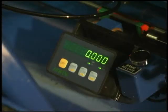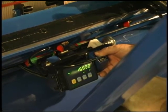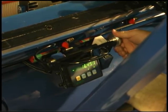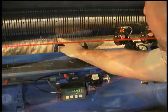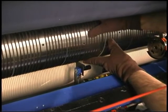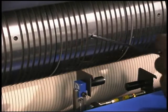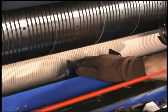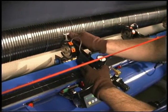Make sure that the counter on the display has been reset to zero and move the knife positioning system to the next measurement. If the female knife needs to be adjusted, loosen the set screw on that particular knife and move it to the desired setting, then re-tighten the set screw. We recommend that you wear safety gloves when adjusting the knives. Once the female knife has been set, place the next male knife into position. Repeat these steps until all of the knives are set.